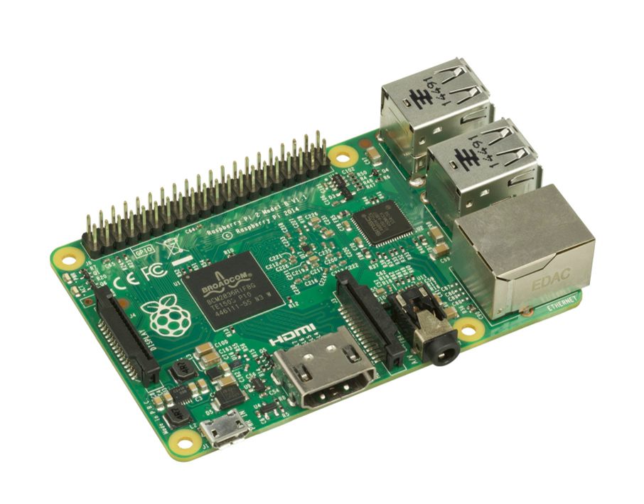Examples of stacking SBC form factors include PC/104, PC/104+, PCI-104, EPIC, and EBX. These systems are commonly available for use in embedded control systems. Stack-type SBCs often have memory provided on plug cards such as SIMMs and DIMMs. Hard-drive circuit boards are not counted for determining if a computer is an SBC, firstly because the HDD is regarded as a single-block storage unit, and secondly because the SBC may not require a hard drive at all, as most can be booted from their network connections.